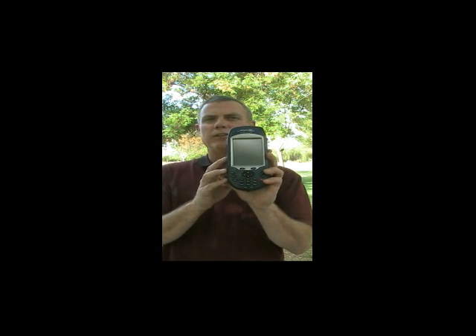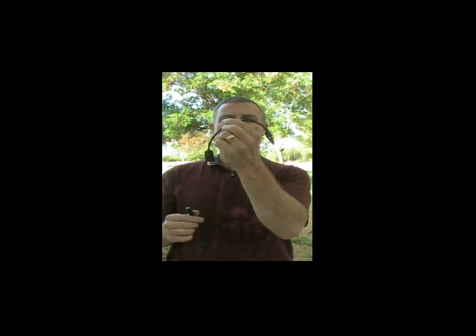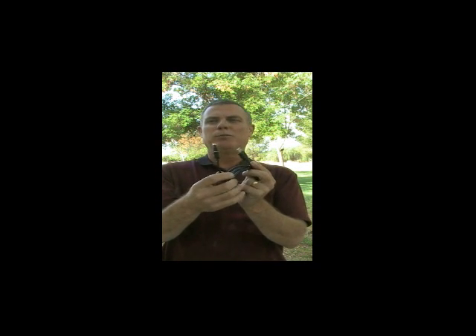In summary, that is the box. I'd like to show you a few of the accessories. The Mobile Mapper CX running Fast Survey is our controller used for land survey and most GIS applications. For cables: you can hook a USB stick up to expand your memory virtually as much as you want. There's a cable that hooks up to the charger plug for external AC power. This is the ethernet plug with an RJ45 connector that plugs into the ethernet jack on the receiver. We have another USB cable — when you plug it into the receiver and your computer, you see the receiver as an external hard drive and can just drag and drop data. It's a very convenient technique.